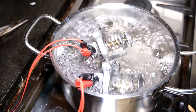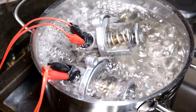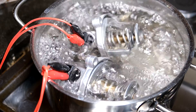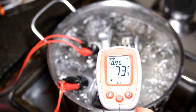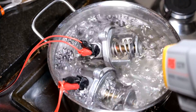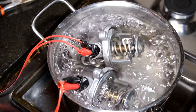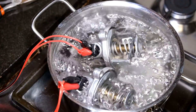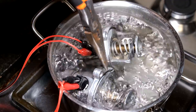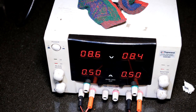At the moment nothing is happening — it's boiling but neither are opening, as you can see they're both closed. Unfortunately I can't get this above 90 degrees. With the infrared thermometer I'm measuring about 70 to 75 degrees on that shaft — definitely not at 100 or even 90 degrees, so neither is going to open from heat alone. What I'm going to do is add some current to assist it. The success criterion will be that the modified one opens more or earlier than the other. I'm setting the bench supply to current-limit at 0.5 amps each.